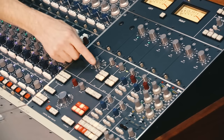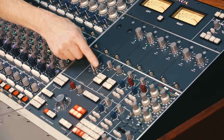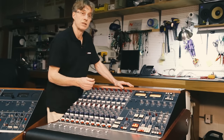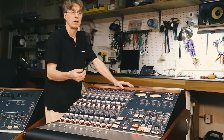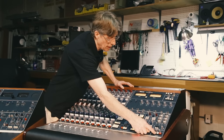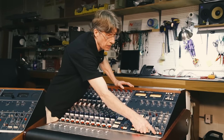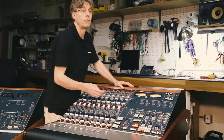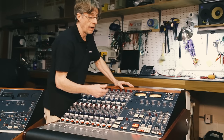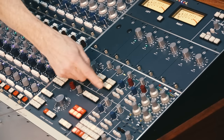Following on from the two-track meter, we have the SLS system. It can be sourced from the monitors, externals, cue bus, or mix bus. It has a cut button and level control, and the SLS send can double up as an extra cue mix for headphones in the studio. It also has a neat option where talking to the studio loudspeakers will cut the program, so you can talk without program going out. Additionally, when you start recording with the red light on, it will cut the SLS loudspeakers so you cannot feed them with program while recording.